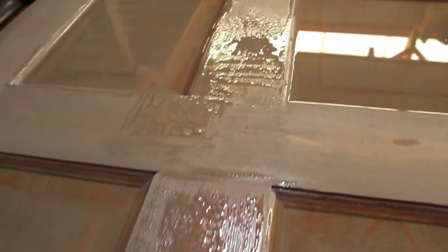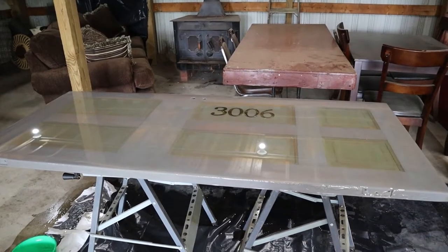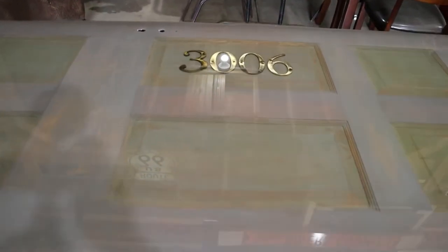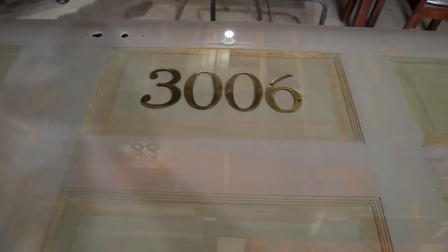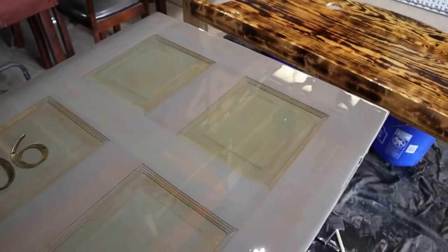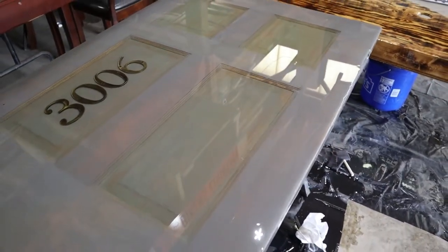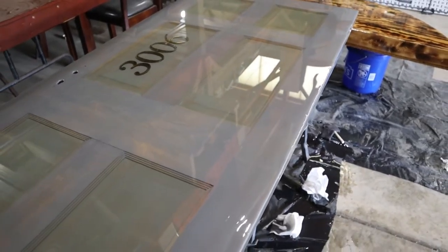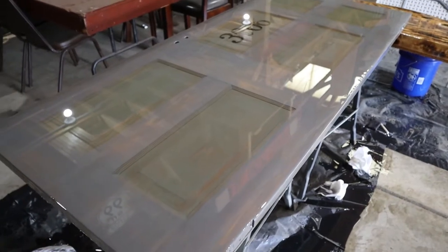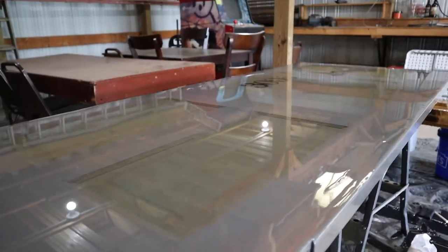The stuff in the middle is just where it spilled over — I took a foam paint brush and just leveled that out. As you pour additional coats it'll cover that right up, you'll never see it. As you can see here, I think this is the fifth and final coat, and after I took the torch to it and got all the bubbles out you get that super nice glass finish. You could always do a really fine wet sanding and then a polish if you really wanted to make it shine and pop, but I haven't done that yet.